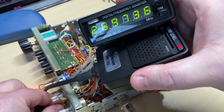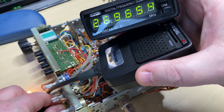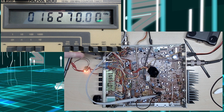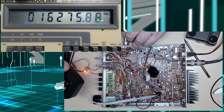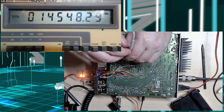I know some of you people out there are probably screaming at the monitor now because you probably know exactly what it is — but don't worry, we're going to get to that because I didn't know at this time. I was having a look at the output of the VCO frequencies: on transmit and receive it's actually changing which you would expect, and it's changing correctly — there is no problem with that. So there must be something pulling it down somewhere.